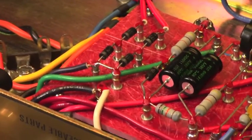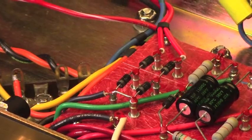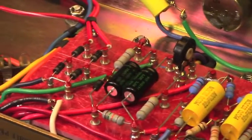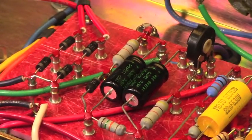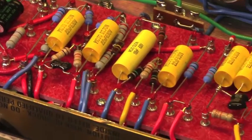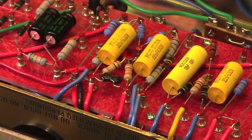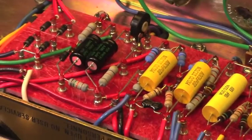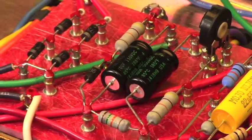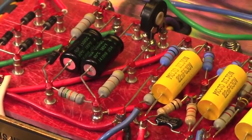There's a standard rectifier here — I like the four-diode rectifier. Some layouts for this amplifier use only two rectifier diodes, but I like four better; I think it handles the chores a little better. You can see the bias supply circuit here with the two capacitors, resistors, and the trim pot. The metal oxide resistors down there are probably overkill — honestly you don't need to use metal oxides there, but I like what they do better. I think they behave better in certain aspects.